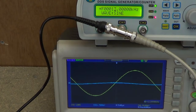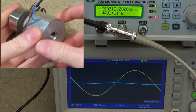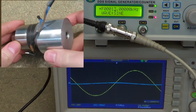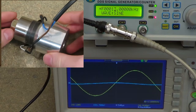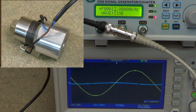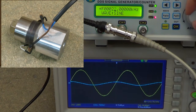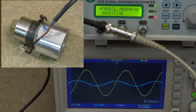So we're starting off with the bare transducer — you can see there's nothing attached to the end of it. These sort of transducers are usually used for attaching directly to the bottom of an ultrasonic cleaner tank. We're currently set at about 13 kHz and I'm going to increase it gradually. 20, 23, 24, 25, 26, and you can see the current starting to increase.